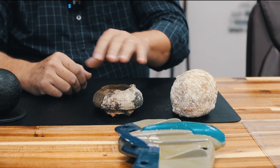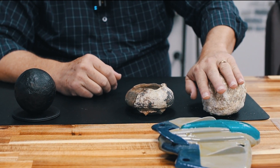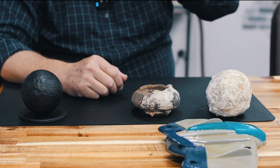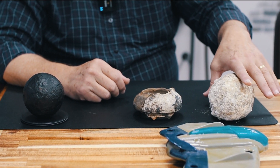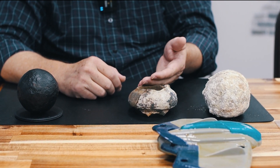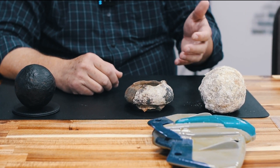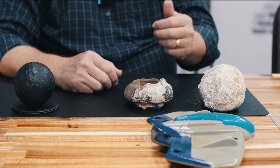When sound travels through water and hits an object like a stone or a cannonball, a certain amount of that sound gets reflected back. That boundary is called a sonar interface. When the sound hits that interface, a certain percentage reflects back and a certain percentage continues to transfer through the object. Every time there's an interface — whether it's the front of the stone, the back of the stone, the front of the pottery, the front of the cannonball — there's going to be a reflection. And that's what we're imaging when the SeaSearcher picks it up as a reflection.